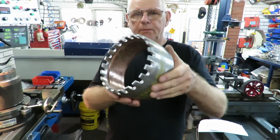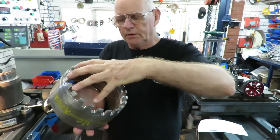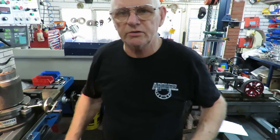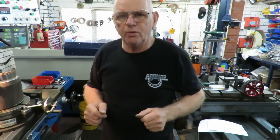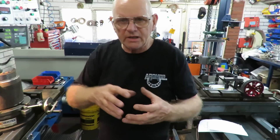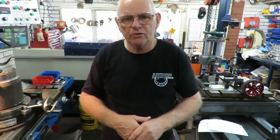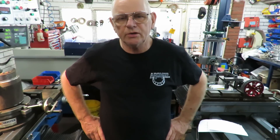This is a nut but this nut has a torque wrench that goes onto it to make and break - unscrewed off the tool. This tool could be 10-12 metres long. In 2012 I made up a tool that connects into the teeth and opens it up, and I got a call late last week saying the teeth have been sheared off in the torque machine and we need it urgently to break out a tool that we have to inspect and maybe repair things inside.